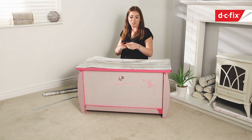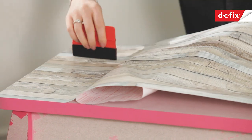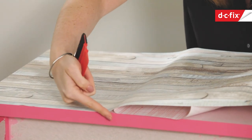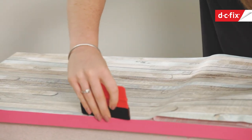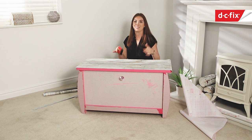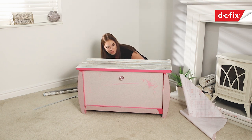The smoother is your best friend here - it's got a felt covered side and you can use that to ease out all of the bubbles, pushing towards the edges so the air can escape. Using the lip of paper, going from side to side, keep peeling the paper back and keeping an eye on the front to keep it straight and flush against the edge. Sometimes you get a sneaky bubble you can't see from one angle, so come down to eye level or jump around the other side to spot any creases or bubbles - it's just worth double checking.